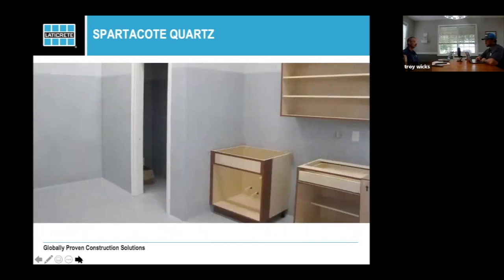This is an installation system where the quartz obviously has gone up much higher, 6 feet up on the wall. It's easy to do these because basically you'll blue tape a line around the room. And we always recommend that if you're gonna do vertical walls that you're using the hopper gun, it is really, really difficult to get a nice look broadcasting without getting a baseball look on the side of the wall. So if you're gonna get into doing walls, make sure that you're using a hopper gun. If we were doing a hands-on right now, we'd be talking about that. But since we're not, we're gonna show you a picture and discuss that. But once again, this room, because it's a monolithic all the way up the side, you come in with a hose and wash that room down and not have any issues with the wall system behind it.